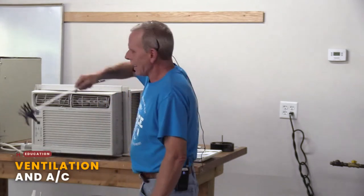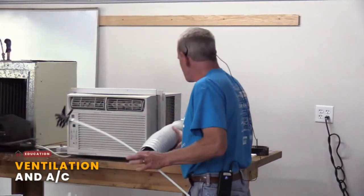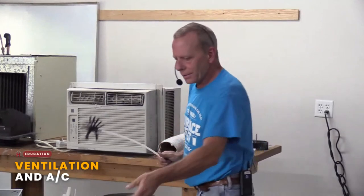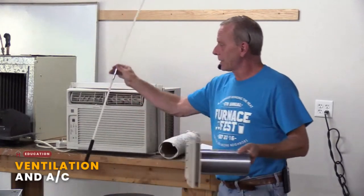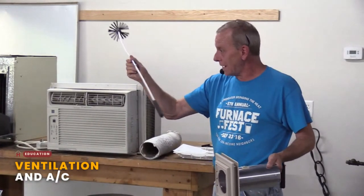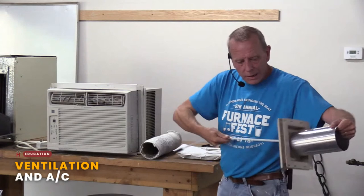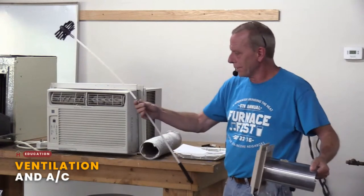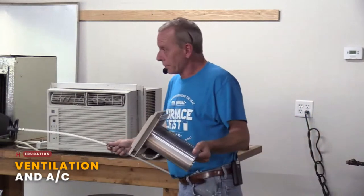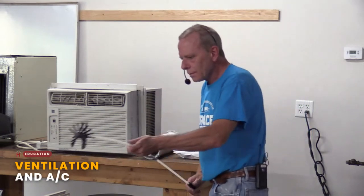And I'll say this in home safety and security also, you should be cleaning that lint filter out. Sometimes they look like this, and you can go from the outside and get something like this. This is really short, but you can buy kits where you have multiples of these. You connect them together, and then what I do is turn the dryer on, get in there, and clean it out. You can get ones that are 12 foot long, and some you can hook to a drill. I usually just do it by hand. But it's important to have that dryer running. You just clean it out, and it's spitting out lint all over the place. But it makes it so it's not going to cause a fire, right?